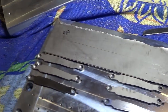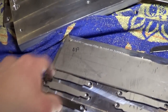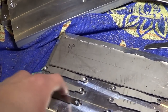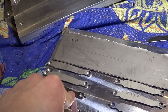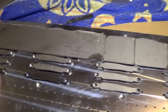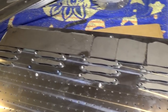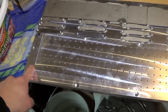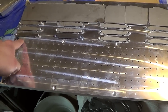So basic operations for the pocket clips are to rough out the profile, which will cut off the tabs and all the extra junk, and then finish profile, and then corner round the top, and then engrave the logo. And that should do it. So tonight I'm going to code the pocket clip code stuff. And this whole section down here will be dedicated to thumb studs and spacers.